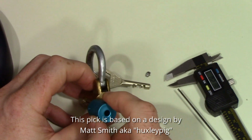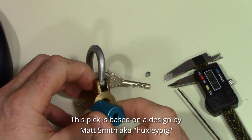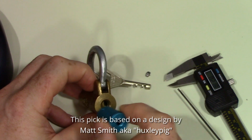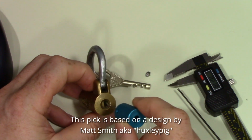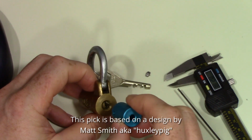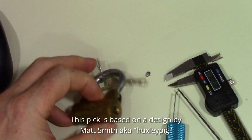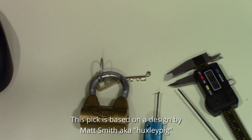But that farthest back disc doesn't give a clear bind indication, but if I don't get it set, then I can't get back and get it in the proper position without affecting the front discs. So I have to get it where I need to be by checking to see when the other discs start to drag, and then I can get it picked. So anyway, I hope that clears it up for anybody who's interested.